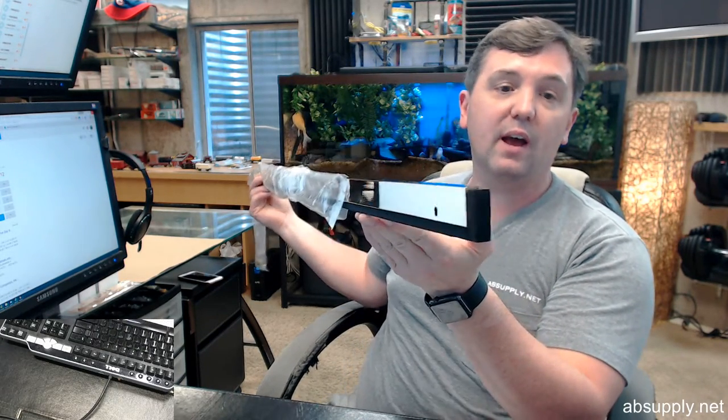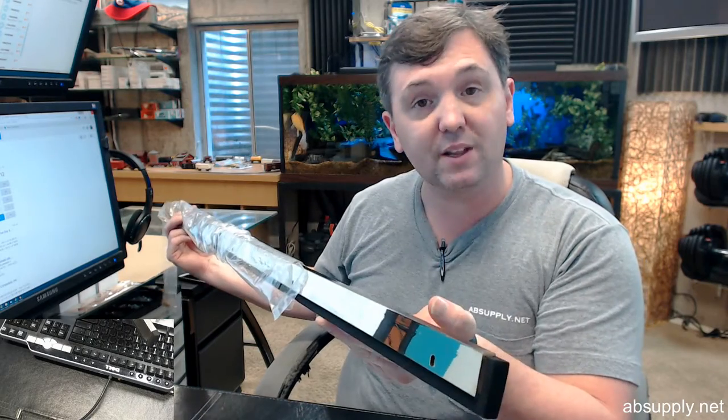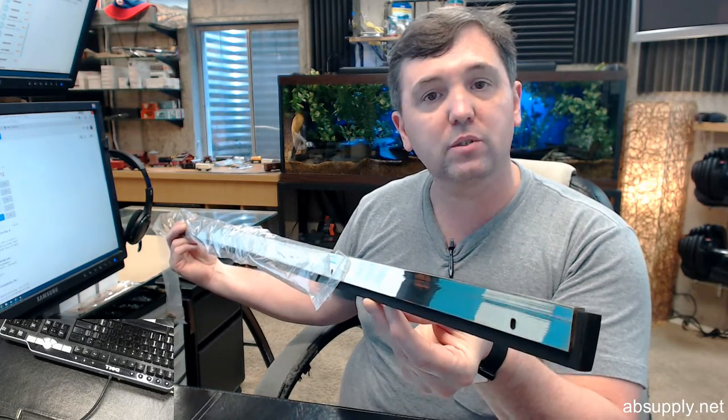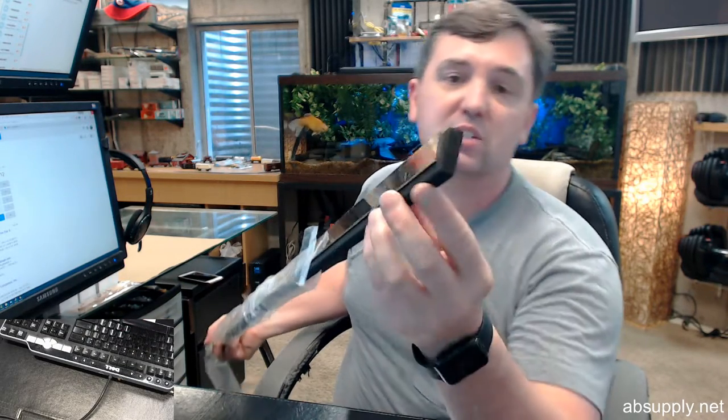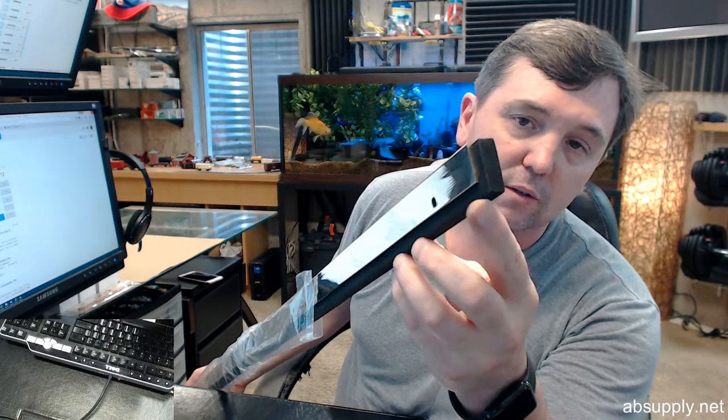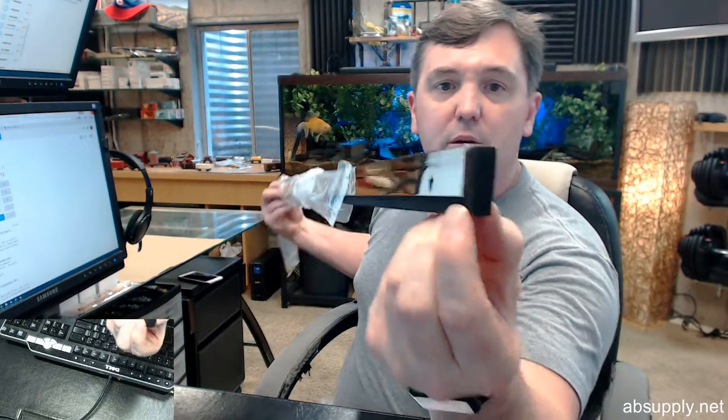This can be used as perimeter gasketing that you'd mount at the head and on the jambs, naturally very commonly used for that, but also used as a sweep, somewhere where you need a significant amount of robust, thick, high-quality insert, like a neoprene would be.